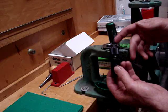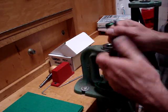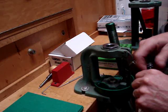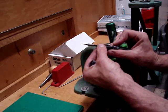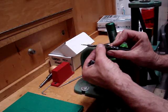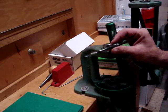The reason why we need to use a threaded die like this RCBS one here is that with the Lee dies, they're held in with a friction collet. This one is held in with threads. When you're pulling the case over the expander ball, on the Lee it'll just pull the whole decapping assembly right out. On this one, it'll stay put.